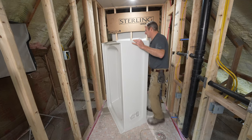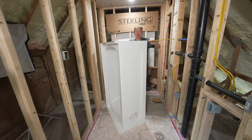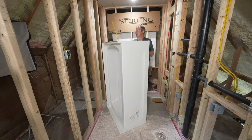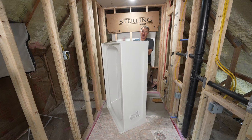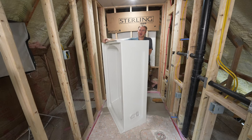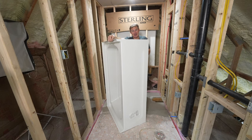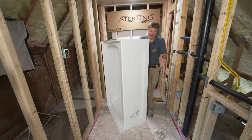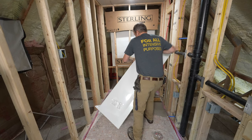We're just going to dry fit this. If you have the ability to build your own alcove, I wouldn't try to make it exactly 60 inches — make it 60 and a half inches because it's going to be easier to move and you can just shim the flange of your tub. A quarter inch on either side isn't going to affect anything, because even if you tile, your wall board would overlap the tub flange. This Kohler Sterling tub has a very thin flange, so you'd have no issues. If you have the ability to make the opening a little bit bigger, it's just going to make everything a lot easier to install.